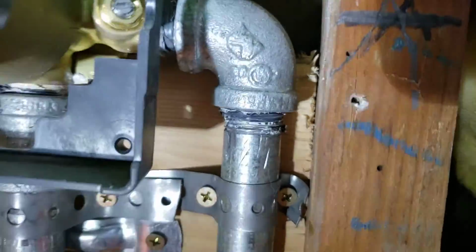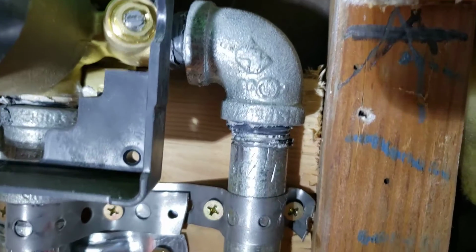But right now, if you just put sheetrock, or what we recommend is cut everything out, nice big square here, and just put some cement board in. That'll make it nice and structural instead of patching the sheetrock. And once that's done, this plastic flange, it's a mud guard, is flush. So finished wall is drywall.